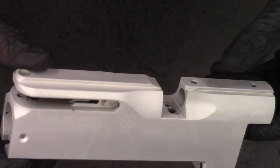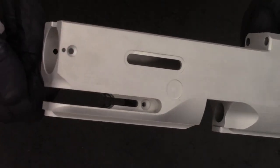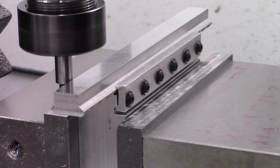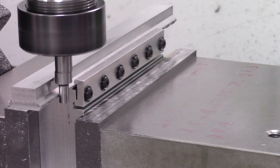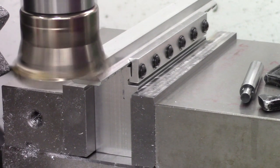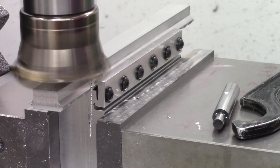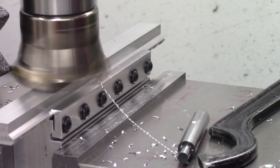Now I didn't make this pick rail — someone made a load up on a CNC mill and I bought a couple of lengths just to have around the workshop for projects like this. We could make pick rails on a manual machine but it'd just be an awful lot of work, so just having it lying around in blanks is quite handy. As always with the mill, the first operation is just to centre up the pick rail, held in a pick rail jig that I made up, and then just take a bit of material off the back. It's quite tall at the moment and we want the pick rail to be nice and low to the block, so we're just taking a few mil off the bottom.